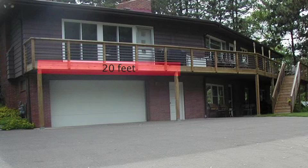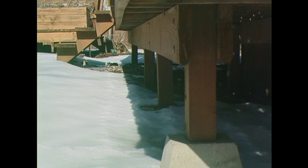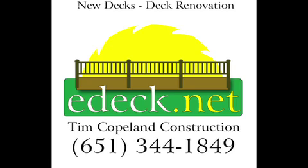For larger spans, you need to use a beam that's strong enough to go the distance — like this one: treated, 6 inches across, laminated about 12 inches deep. We see a lot of situations where the beams are just bolted to the side of a post. Sometimes the post is even a 4x4 and it may not be fully seated. That method can allow the beam to twist. This is how I like to do it — where it's notched into the 6x6, and the back of the 6x6 offers support against that twisting. If you have any questions about any of this, feel free to give us a call. Thanks for watching.